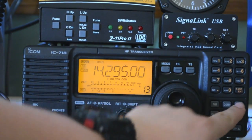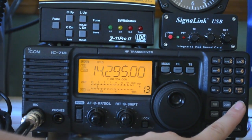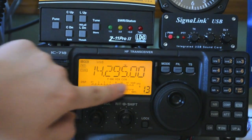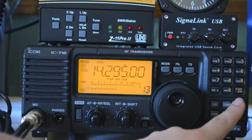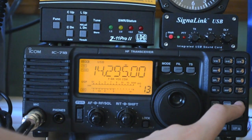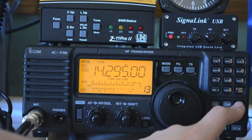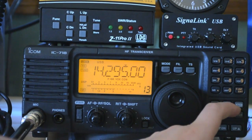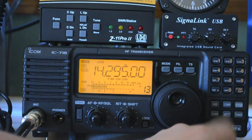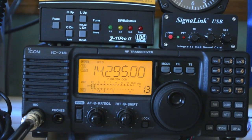You've got your set function over here. What that does is it lets you display your power meter right down here, your ALC — automatic level control — and it also shows your SWR. Those are some very neat functions. When you measure your SWR, you always need to have it on either RTTY or AM mode, or else it won't be accurate and it'll be going all over the place.